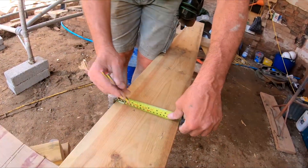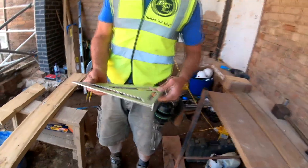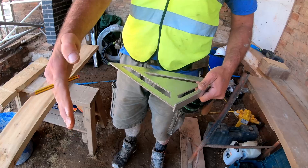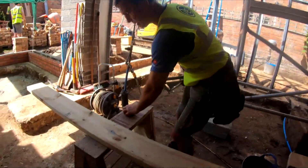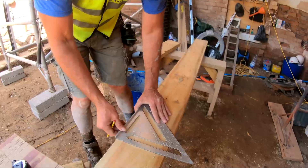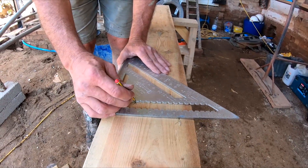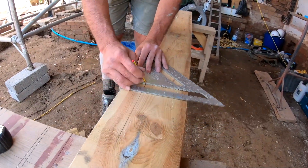Next you go to the roofing square. There are different types — some have a pivot point where you can move the arm, and some people use a big roofing square about two and a half feet by one foot. For marking out the bird's mouth, first thing I do is find 65mm on the roofing square — there it is. I wouldn't want to go past that mark; I like to keep it underneath so you're not taking more timber out than needed. Basically I'm scribing that now.